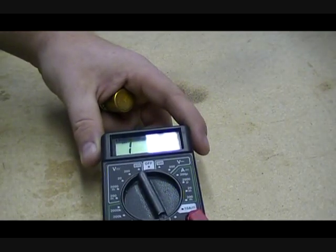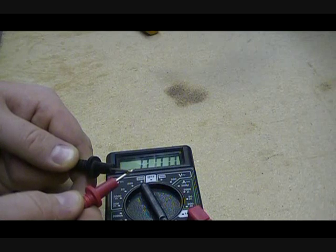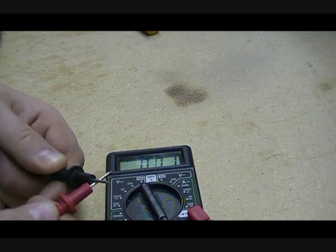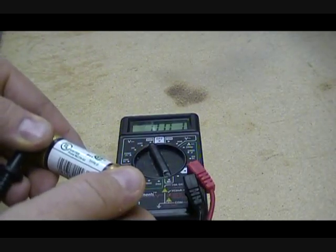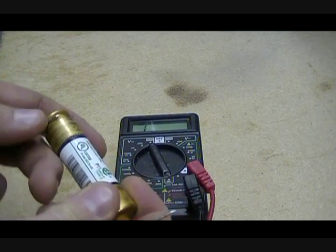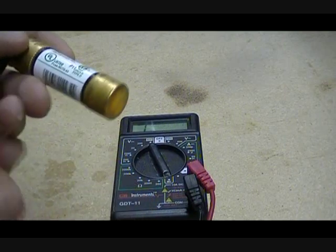With the other cheaper meter, this one doesn't have an audible tone. It just shows a one, meaning infinite resistance. When you touch the two leads together you get zero zero zero, meaning there's no resistance in the cables and they're ready to be tested. Grabbing the fuse and doing the same test — touching one lead on each end and pressing firmly — the meter reads zero zero zero, and everything's okay. This fuse is good.